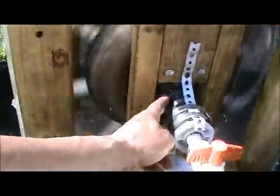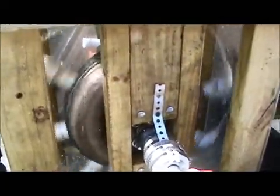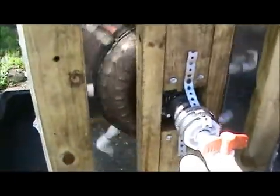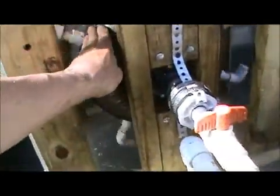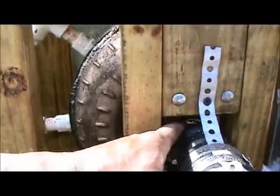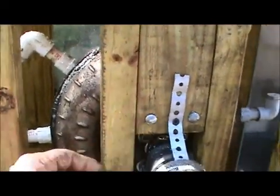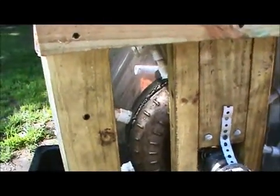There's still another test. You can see what the initial test pressure is — it's a little wobbly because I got the PVC plugged in there. I had to make an O-ring to plug into there so it wouldn't leak, and I used that little same bearing for the time being. I made a little bushing out of PVC, put two O-rings in, and just plugged it right in to seal it. Looks like it works very well.